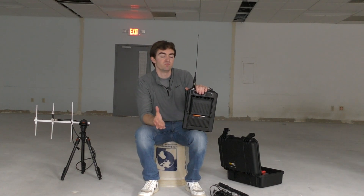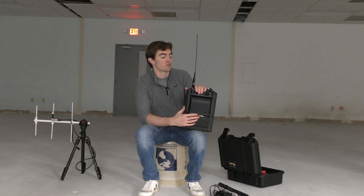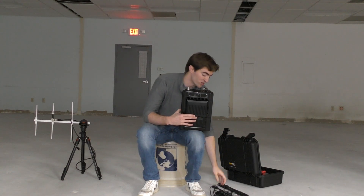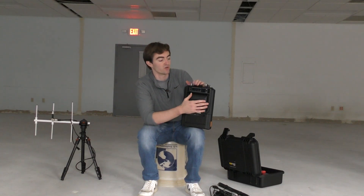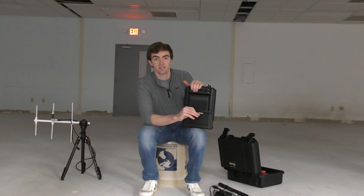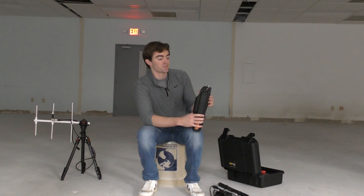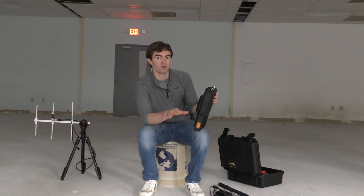You might also wonder: can I do both? And the answer is yes, as long as you're comfortable taking the duplex route. If you're running a traditional analog or digital or mixed-mode auto-switching repeater and you have your duplexer installed and tuned to your frequencies, you can still do SFR — you need the SFR license on the radio repeater — and you could have channel one be your traditional repeater mode and channel two be your SFR mode. But when you switch to that SFR mode, you're going to need to remove the duplexer. That's just a couple of screws and connection points, so if you're comfortable doing that, you can have the option to run either SFR or traditional analog-digital repeater mode.